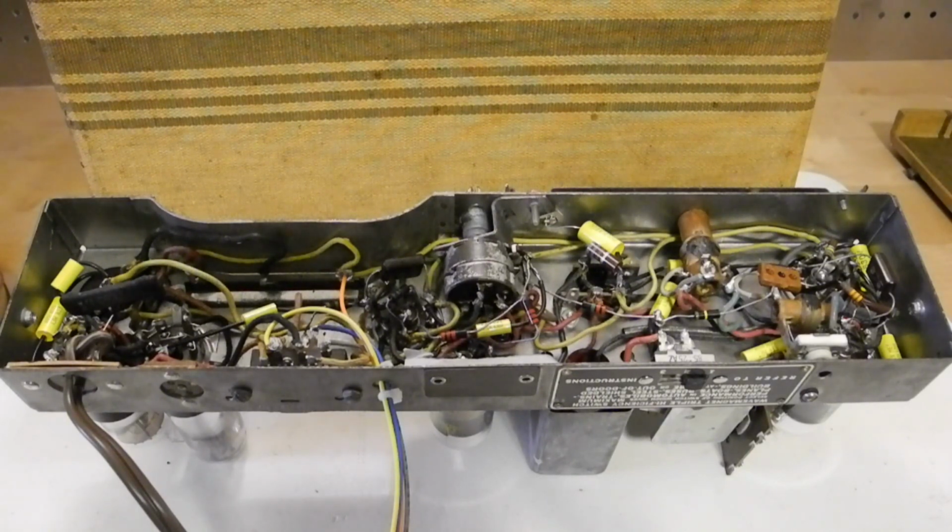Fortunately, the chassis is not connected to this ground. The chassis is connected to the AC line via a capacitor, so there is a danger of shock if this capacitor becomes leaky. The two screws on either side of the case are connected to the chassis, for example.